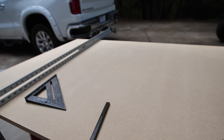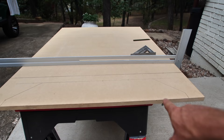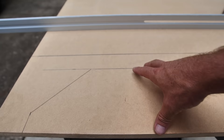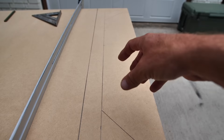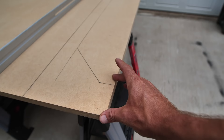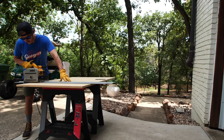Here's the math — hope it works out, usually doesn't with my woodwork. I'm using three-quarter inch condensed board; this isn't actually plywood, it's a little expensive but I just had it laying around. I would prefer plywood but it's really heavy and it'll work just fine. Working with the dimensions of the raw wood: three feet wide, eight inches deep. I've got some 45-degree angles in here just to push rods into the center, and I'm actually going to have some notches to separate categories — probably bait casters, spinning, crappie, saltwater, catfish. I'll take the track saw straight across, make a nice clean cut, then take the jigsaw to clean up the piece. Basically we'll have two of those, put some little blocks on the end to attach to the ceiling, glue them up with pocket holes, find some studs, and wham — we've got a rod holder.